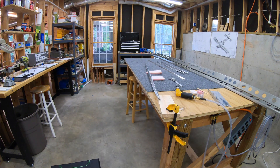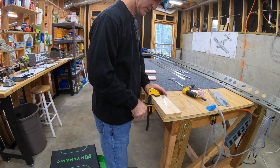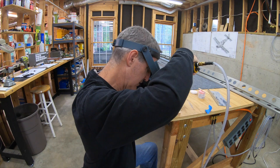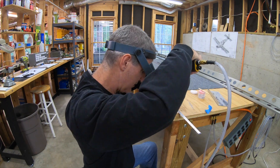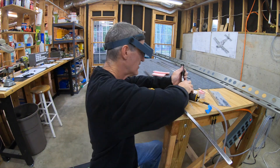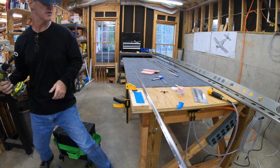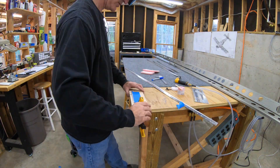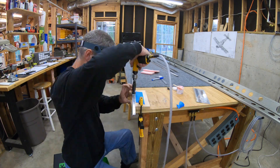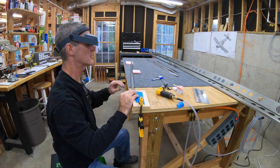You can also see that I've switched to my pneumatic drill, which presents its own set of problems, but for the most part I get much more consistent results. I'm happy with how these work out on the long stringers. I sort of have to get a running start with the pneumatic drill when using the single-bladed cutter - I figured out later that switching to the three-bladed cutter made it easier to get good results with the pneumatic drill. For the most part it's working okay: I get the drill up to speed before making contact with the part and away I go.